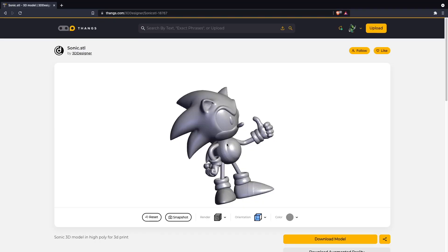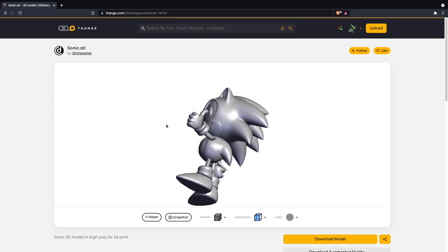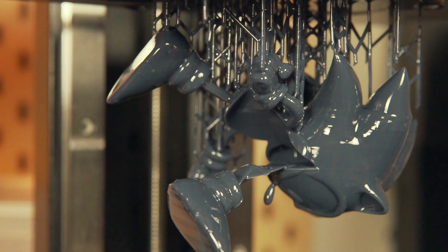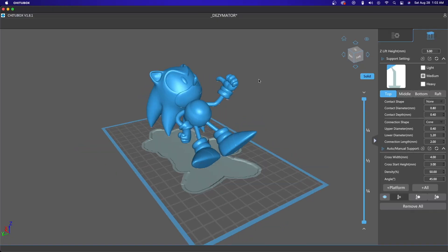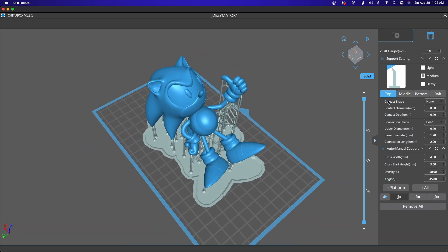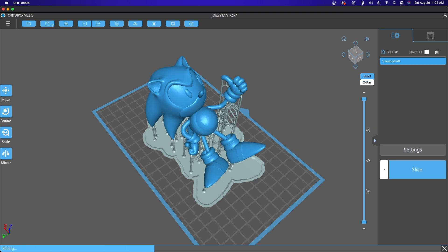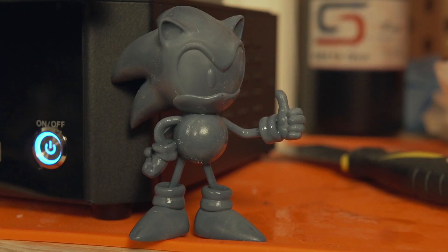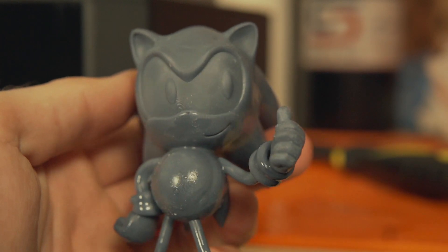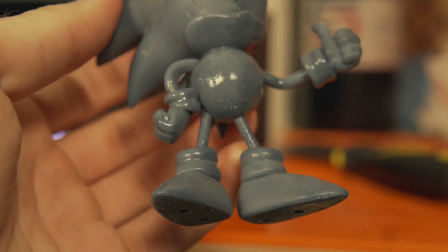With the glow resin cleaned out and the navy gray poured in, I found an awesome model of Sonic the Hedgehog by 3D Designer over on Thingiverse. Originally I tried to print him solid but ran into issues with the supports not holding well enough, making for a pretty epic fail. I've printed similar models with the same support settings in the past without issue, so I do think it's still a case of the build plate being a bit too close to the FEP causing aggressive peel force. I then took the exact same model, hollowed him out, positioned him a little differently, and was able to get a successful print. For those who spotted it — yes, he is missing his nose, and that is not the printer's fault but my doing. When I cured him I grabbed him by his head and his nose was so delicate that it snapped off and flew somewhere in my living room.